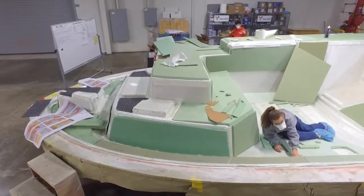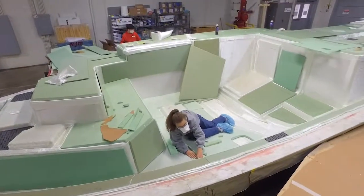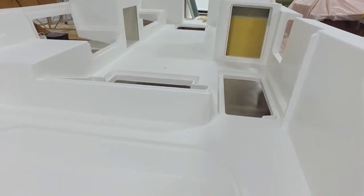To be able to infuse an epoxy deck on top of a vinyl ester skin coat, we did a lot of lab testing with the epoxy supplier so we were absolutely sure we would not have a bonding problem between those two surfaces. Today we build and infuse grids and decks, which are much more complicated than building a hull. We're able to take full advantage of the laminate design and the fibers, and build a very light, stiff, strong deck.